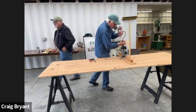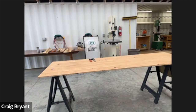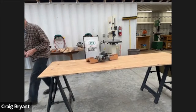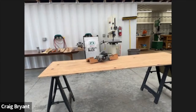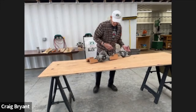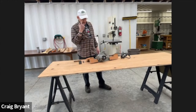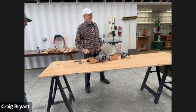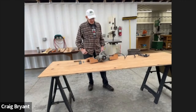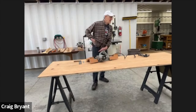You'd have trouble with 12-to-1 just because it's very difficult to do the plywood feather edge at 12-to-1 without destroying it. It's so thin that if you even breathe on it, it'll break. The same is not true with solid lumber. With solid lumber, you could make the lumber thicker and plane it after it's glued. I used to run my scarf through the planer very carefully, only in the correct direction. But I've forgotten, and it doesn't matter. Even when the little feather edge is going straight into the cutters, if you epoxy that thing together, it's more like one piece of wood than two. I've had them split elsewhere where the cutter picks up splinters, but I don't get tear-out in the scarf.